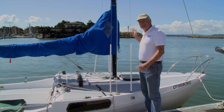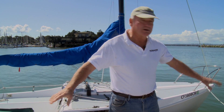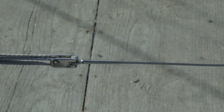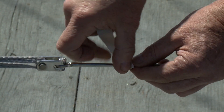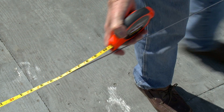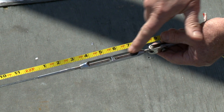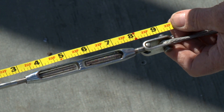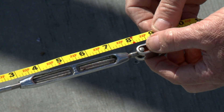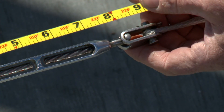The CF-500 can be installed with the headstay on the boat or with it on the dock. Both methods of assembly are described in our instructions. It all starts by suspending the wire on the dock, tensioning it, and then getting our dimensions for cutting the foils. What we're looking for is the length from the bottom turnbuckle toggle to the top of the wire below the swage stud. We tape the tape measure on securely and then go to the bottom end and measure the overall system length. Notice that the turnbuckle has been closed completely so that we have the shortest possible headstay — this will help avoid any contact between the upper swage stud and the foil itself. Our measurement point for what we call the ML dimension is at the bottom of the T-bolt at the top of the toggle, where the clip will go through the toggle.